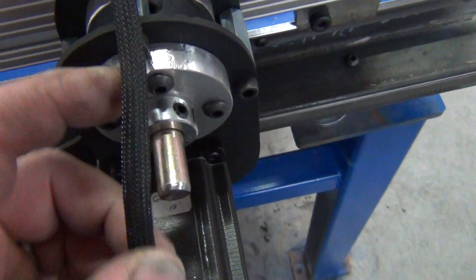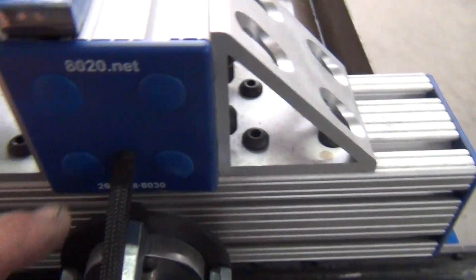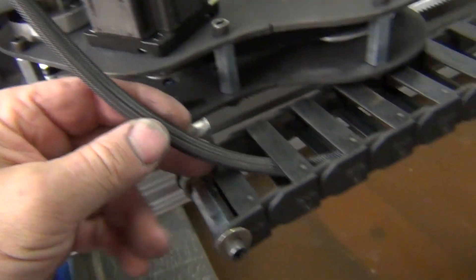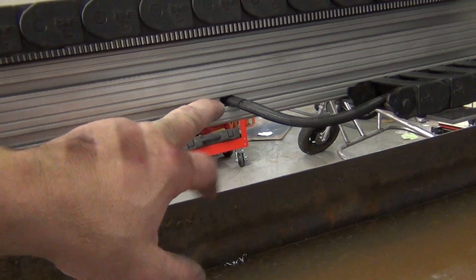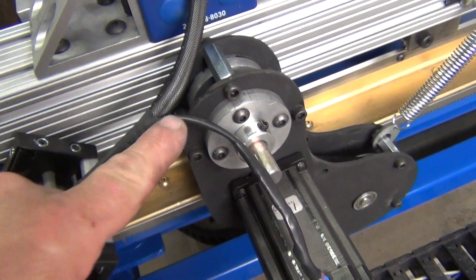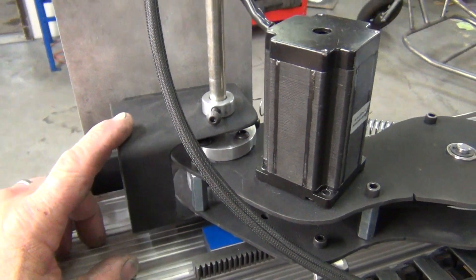I ran some really nice highly abrasion-resistant cable wrap into some heat shrink tubing, ran that wire through the center of the gantry 8020 material. On my other motors they connect up here — same thing, heat shrink tubing going into the wire wrap into my e-chain. It comes out of the e-chain, and I drilled the hole on the back side of my gantry and have those wires running in there. They link up with the wire from the other side and all three exit on this side of the gantry, again with the cable wrap split loom, ran the motor wire up into the loom, hit it with heat shrink into the e-chain, and down it goes.